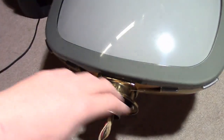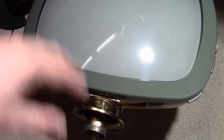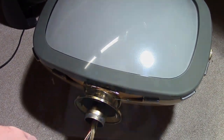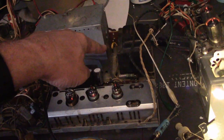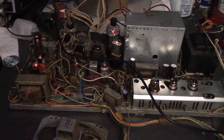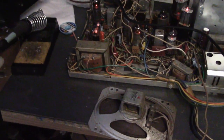As I've done on other chassis, I'm going to replace it with a type J, very reliable, military-grade potentiometer. The used picture tube has been transplanted into the Debutante shell. While I had it apart I cleaned up the inside, and now I'm putting it back together. I went over everything again: removed corrosion from the high-voltage box, replaced the line cap — the capacitor across the AC line — replaced the one cap on top of the tuner, cleaned and lubed it, checked those two tubes — they're good. I think I've done as much as I can. I did replace and mount the new linearity control, which I'll tweak with a test pattern generator.